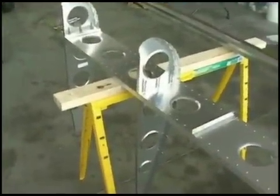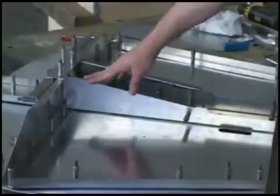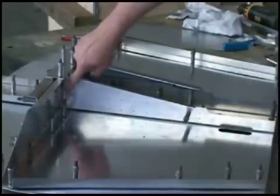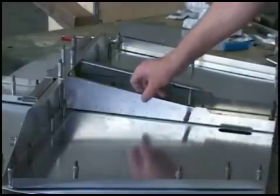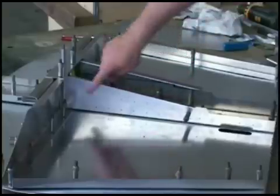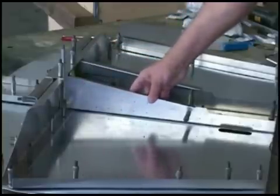We'll move on to number three. I've Clicoed the gusset back in place and Clicoed it at the top flange up to the shelf, and at the hole we drilled down here. That will affix it in the proper position to the center channel behind it. Now we can drill through our pre-drilled holes we just made and Clicoed it to the center channel.